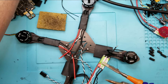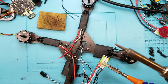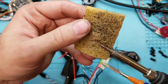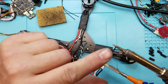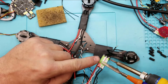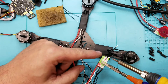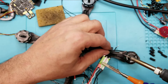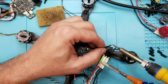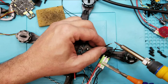I'm going to go down to 400 degrees Celsius. The oxidation on your tip builds a layer that keeps the tip from getting as hot as it should. The other thing you want to do when soldering is to pre-tin your parts. You can see here I pre-tinned all of the ends to the ESCs, and I've also pre-tinned the leads for the motors. Don't be afraid of using too much solder on these lead wires.